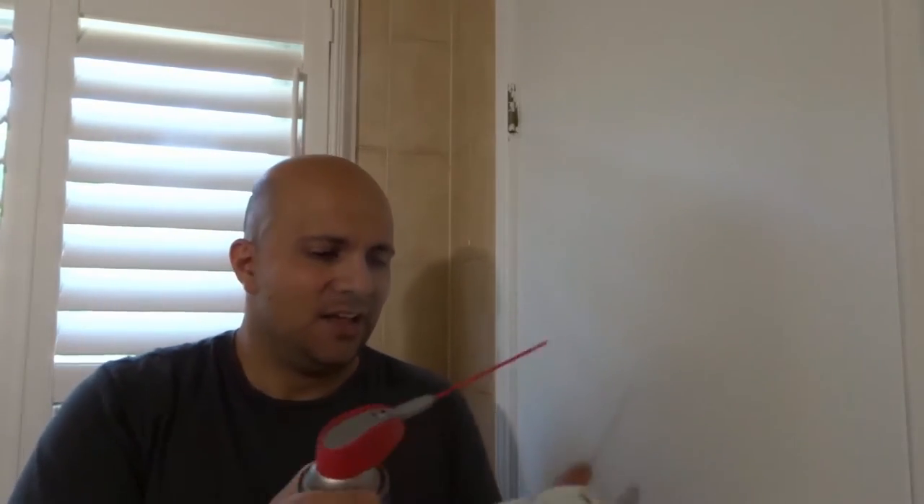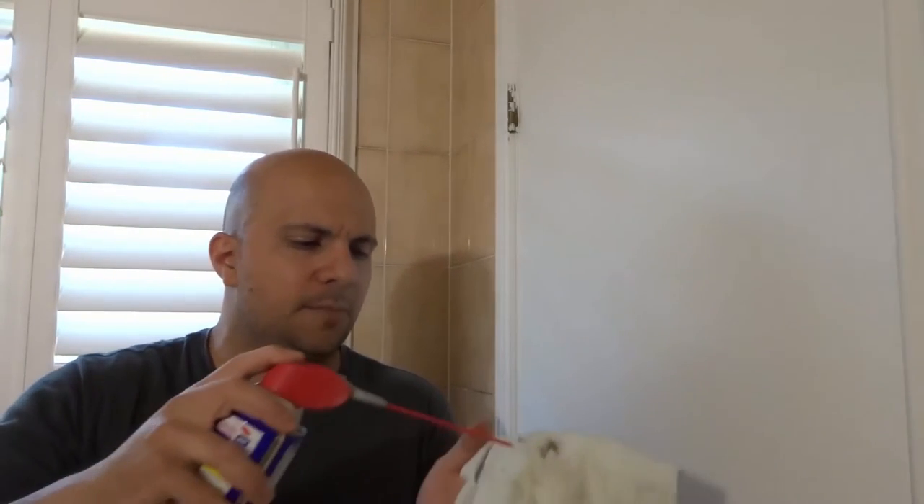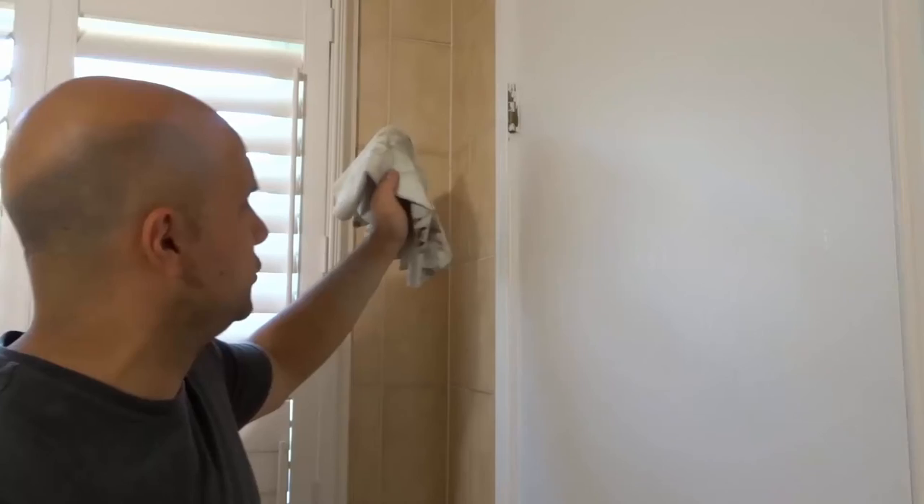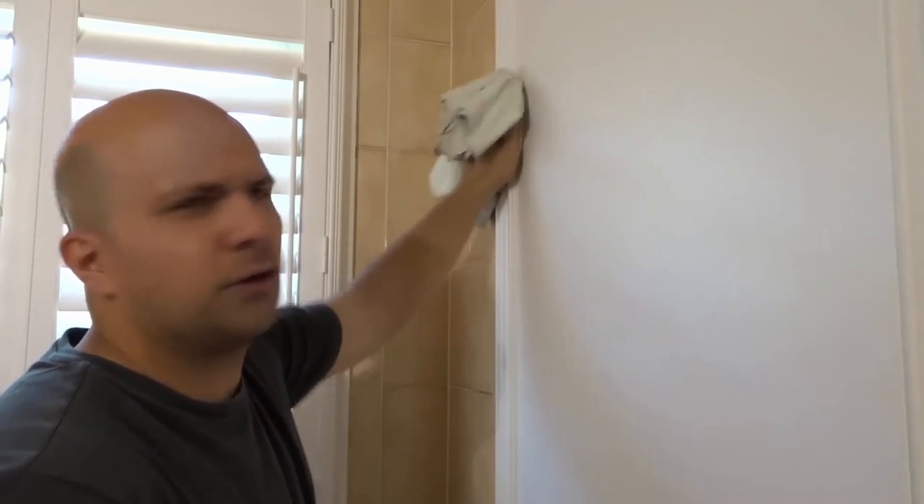You want to avoid that. So what I'm going to do is spray the rag with a little bit of WD-40 — not a lot, you just need a little bit. So spray the rag, try not to get it on the floor. Now that I have the WD-40 on the rag, what we're going to do next is take that hinge pin and rub it with the WD-40 on the rag. That's going to get off any grime and dirt and lubricate it. Next, we're going to take that same wet WD-40 spot and rub the outsides of the hinges to sort of prime them and get them ready for the WD-40. Now I'm going to take the hinge pin, move it to the side, and I'm going to take my WD-40 and actually spray the hinges. You don't need a ton, you just need a bit because we're going to sort of circulate it in a moment.